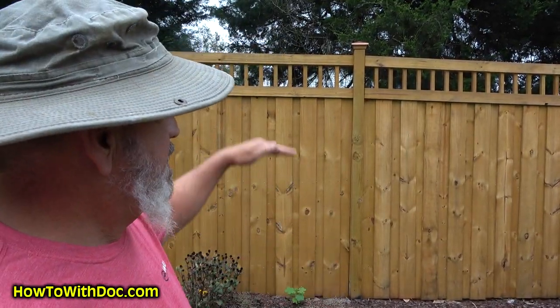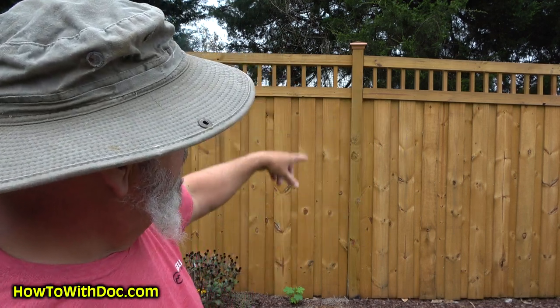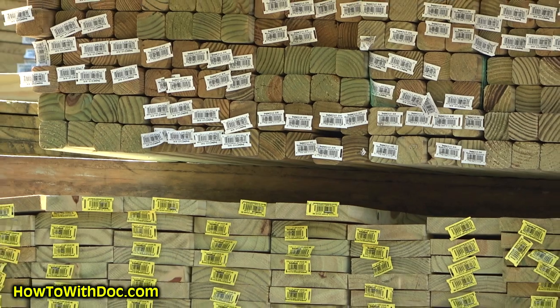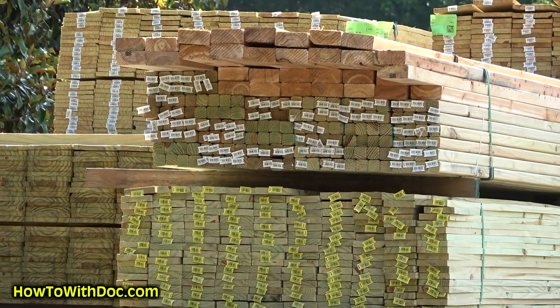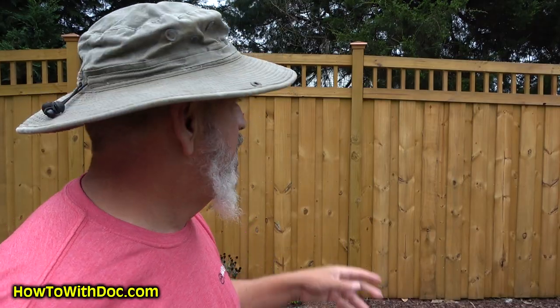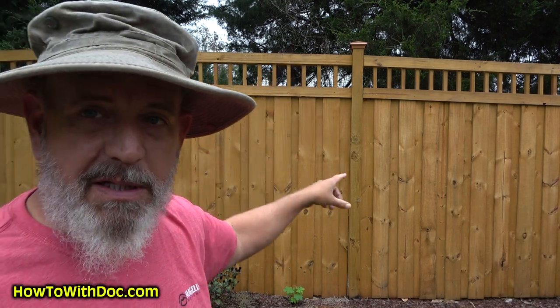Since I have a six plus one plus a little extra for the caps — these are caps, I'll put a link in the description — these are just accessory caps you can buy, put a little carpenter's glue on and stick on top of the post. All the wood is 4x4 pressure treated, it has that yellow look to it. I think it's important to have your wood match. So I've got six foot of post, another foot, and then a little bit more plus my depth — these were probably close to 12-foot posts.